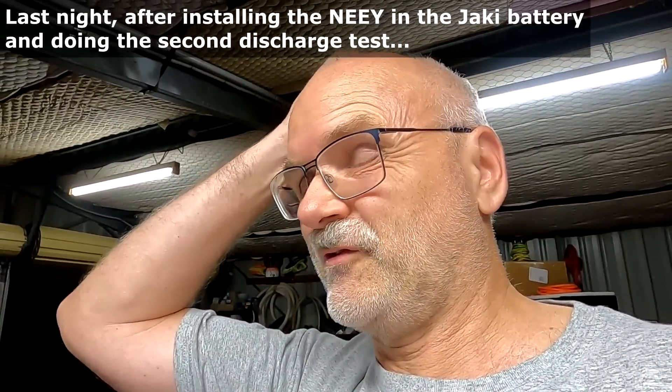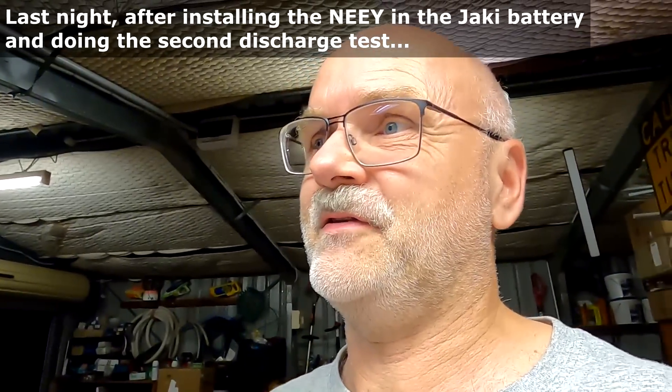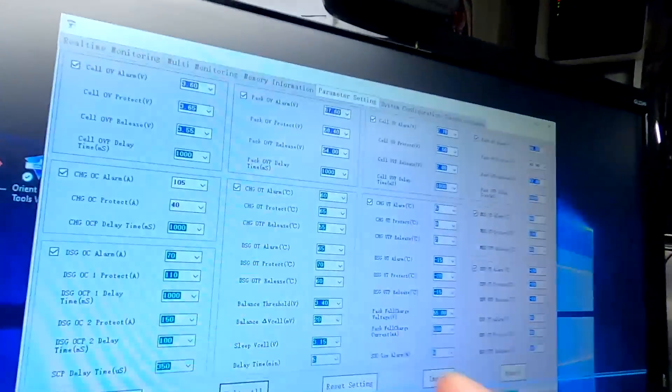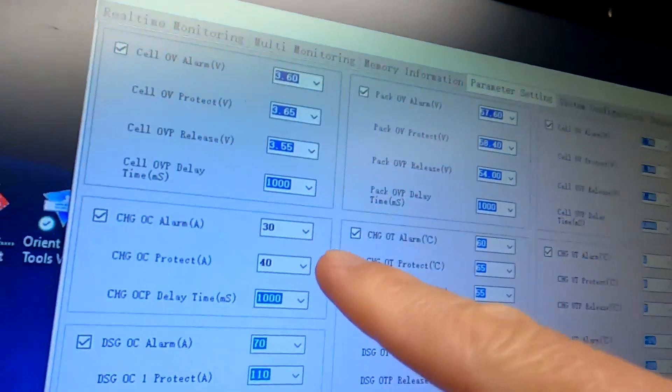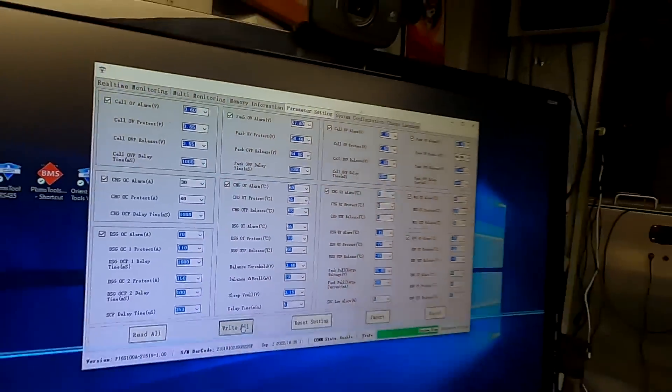I'm not sure if this is a good idea, but we want to do an experiment. My battery supplier told me that the current limiter of the BMS will kick in if the charge current goes over 100 amps, and they also said if you reduce your overcurrent protection to say 50 amps it will kick in then. So I've set it now to 40 amps. I've written the information to the BMS - allowance sits on 30 and protection on 40.